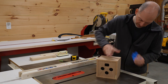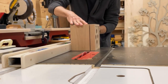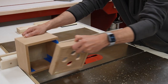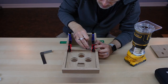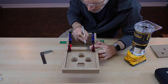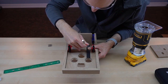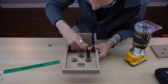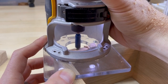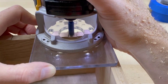Once the glue dried, I prepared the box to have its lid cut free. I set the table saw blade just high enough to cut through the wall thickness and then ran the box through four times, taking care to keep it tight to the fence so that the cuts didn't end up misaligned. Then I prepped for the hinges, which is fairly straightforward to do, but does require a bit of finesse. After clamping the box halves together, I positioned the hinge and scored its edges. This not only gave me a visual reference for cutting, but it also severed the fibers, which helped me produce a clean final result. I always route small hinges like this freehand and slowly creep up on the score mark. If you closely watch the behavior of the wood as the router approaches the score line, it'll give you a cue to let you know that you've hit the line. You can just see the scored fibers get wisped away.